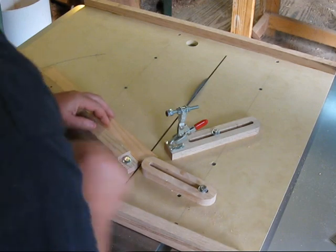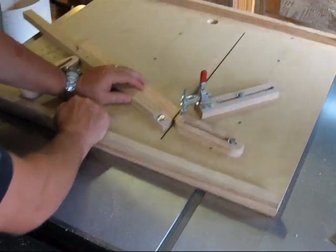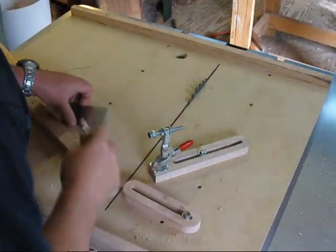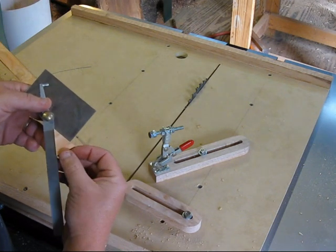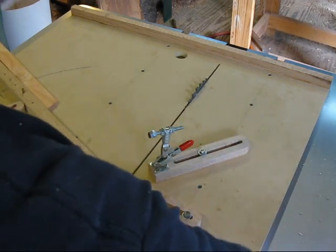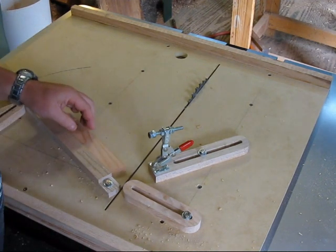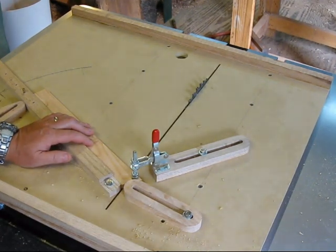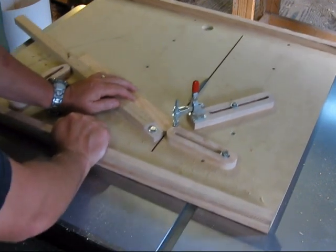Barely trim that off, come back, lock that down. Right. Okay, well, this last piece I cut, the protractor says is 45 degrees, dead on. So we move into the second part, which means I'm going to cut another segment and see if those two segments together equal 90 degrees, because you can't just go by the 45 yet. I'll cut another segment.